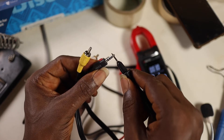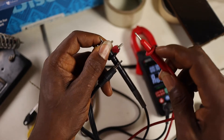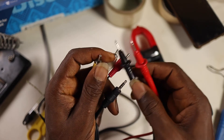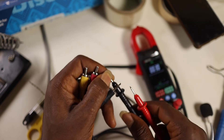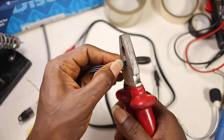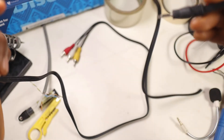So the wires are white, red, and yellow. Let's confirm by measuring with a multimeter — yellow is this one, as you can hear the beep. The others will not beep. The next one is red. It's important to know the configuration of the AV cable. I'm going to cut this cable and solder the connections, because I always like to solder. I've shown you the configuration and you can also use tape to join the wires, but I'll solder it — that will be shown in Part 2 along with all the details.